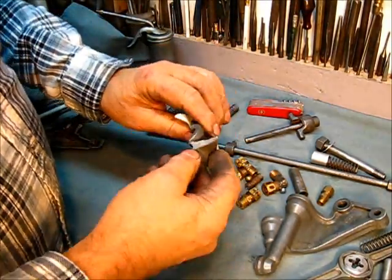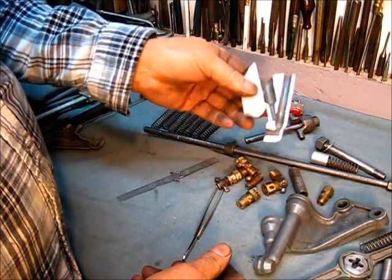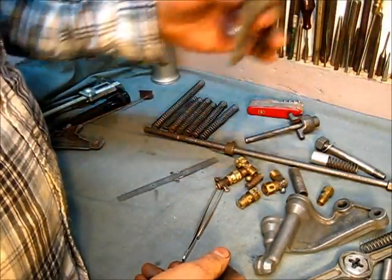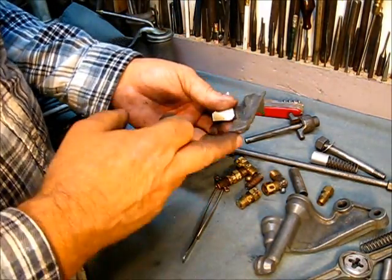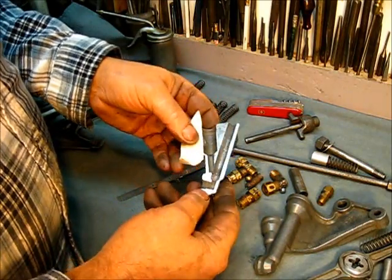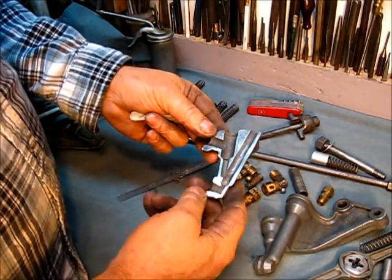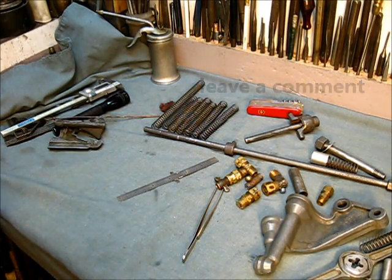This material and this pump is in harm's way to begin with. If they mounted it too low on the engine — I guess the engineer was asleep when they mounted it as low as they did — because if it's not on the skid, the least side-over rocking motion will break the fuel pump. If it's sitting on the ground with no skid, it's just moisture that deteriorated these in storage. Most of them, if you see them broken, will have a lot of voids — it looks like the metal was too hot, with little air bubbles, especially in the thicker sections. Okay, let's pack this pump here.